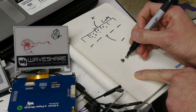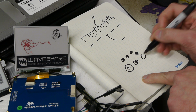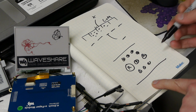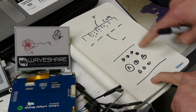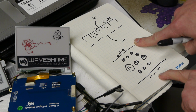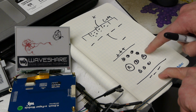Imagine that you have black pixels that are small and positively charged, and then you have really large red ones that are also positively charged, and then you've got small white ones that are negatively charged. So then if you put this thing between the 2 electrodes, the large ones and the small black ones will have the same motive force applied to them. If we put this field here, minus on the bottom and positive on the top, both the red and the black will be attracted to the top, let's say, but the red ones are going to move more slowly because they are bigger, even though the charge is about the same, and it's in this viscous sort of fluid.